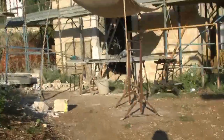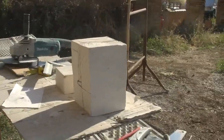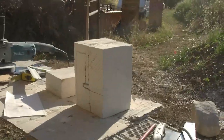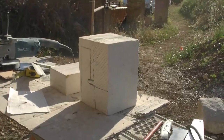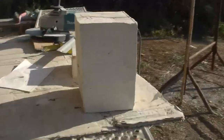So, okay, this is crunch time and that means working on the keystone. What you'll find is I've got a load of lines on it now. I've done a second measure. I'm just taking you around it, and the idea is to get this with as many flat sides on, which I think I've done now, so that when you do turn the stone over, you're not resting the stone on a wonky edge, because obviously you're not going to get any purchase when the grinding machine sits there. It's very powerful. I need something very positive for it to sit down, so that cut is very clean, very straight.